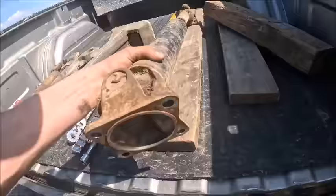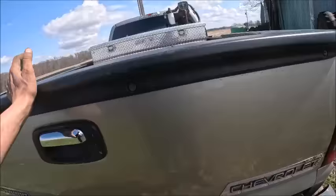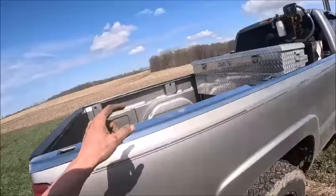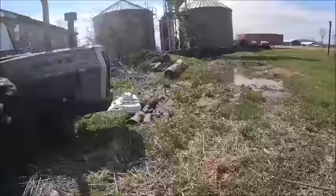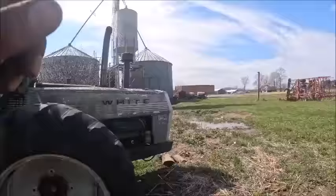And I think once the 4150 parts ran out, the 175s might have those heavier shafts too. I don't know. I've never been around one, because there's not nearly as many 175s as there are 210s. But I think that was actually the replacement shaft if you had to replace the drive shaft in one of these. That 4210 sitting on the other side of that soil finisher has the same shafts in it, and I was gonna steal one out of that, but unfortunately the upper shaft in that has a big old dent in the tube, and that's not gonna work that great.